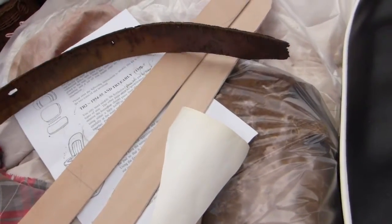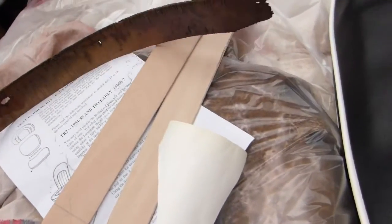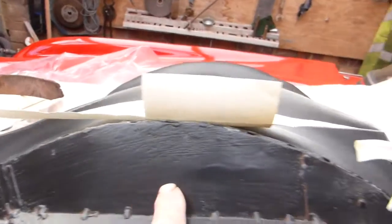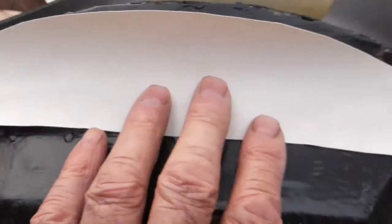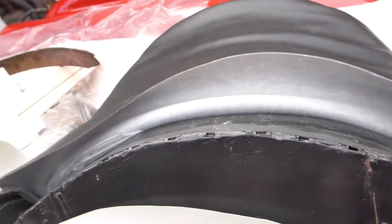This is the piece of three-ply: 760mm long, 40mm wide — there are two new ones for both seats. Because of pulling the back tight, I'm going to cut a piece to put in there, and another piece down the side. Then when I pull it tight I can staple it in and check that it's tight enough before I fix it permanently.